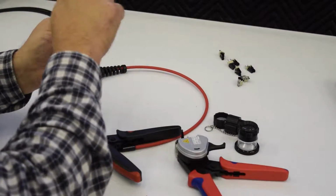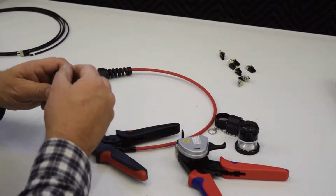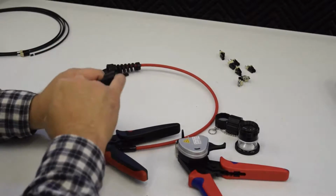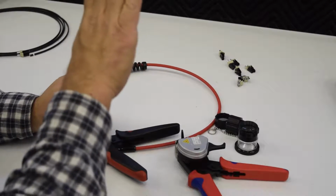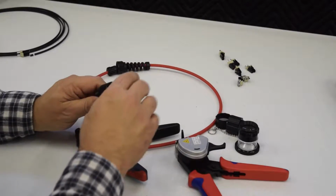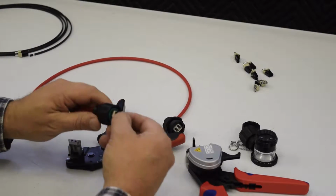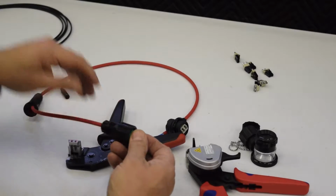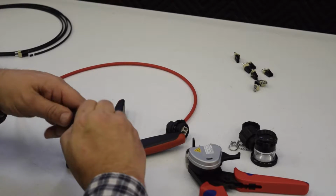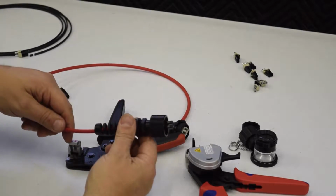Now that both of the fibers are at the right location and it's crimped on, the last thing that we do is push it into the housing, and part of the IP67 housing is an actual holder in there which holds both of the latching features of the connector down, so it will go inside of the actual coupler itself. So the connector's in place, we'll push the compression ring on, and then we'll tighten the strain relief down. You can feel it kind of snap in place, and that'll actually crimp on to the housing.